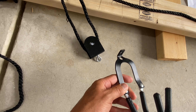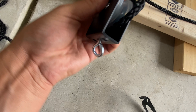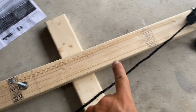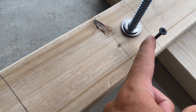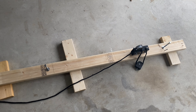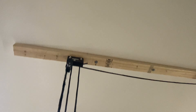I also removed the really long hooks from the lower pulleys and replaced them with eye bolts — I'll show you why in just a second. I pre-drilled and added three lag screws and washers to the mounting board, and added a couple of drywall screws so that when my wife helped me raise the whole assembly to the ceiling, I could quickly attach it while she held it up with a small support I made, while I lagged the big screws in.